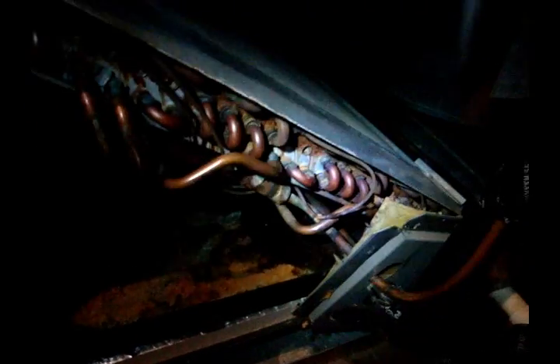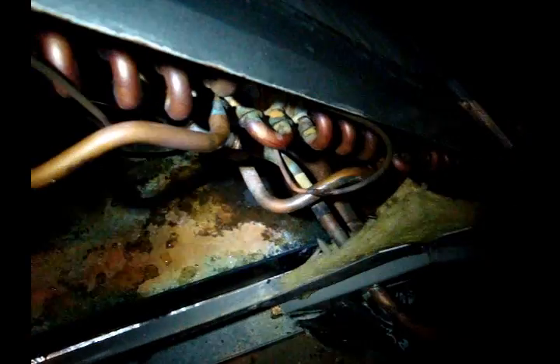We're putting the filter dryer in somewhere in that general area. Typically I'll put it about 12 inches or so outside of the air handler, but there's not a whole lot of room here. I wanted to keep a little bit of space for getting the service doors off and accessing the coil. So I put it up here a little farther out of the way. It's holding pressure, so as long as that stays good, we'll be evacuating and charging this bad boy back up.